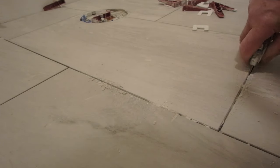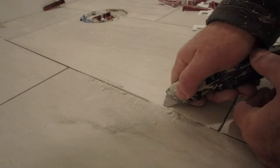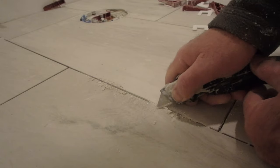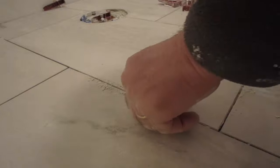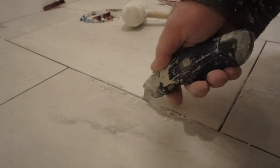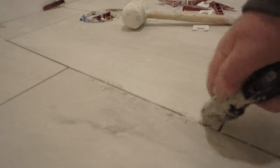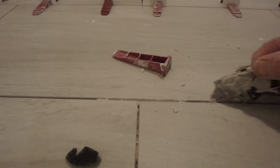underneath. So I just want to make it perfectly clear. When you're scraping out the cement in the grout lines, do not go too deep. This is where most wires get damaged. Exactly at this step, when you're cleaning out the grout lines, you forget the wire is there, you go too deep and you cut it. So be very, very careful.